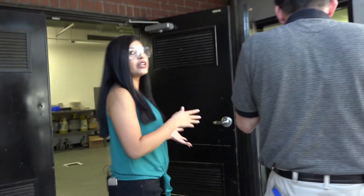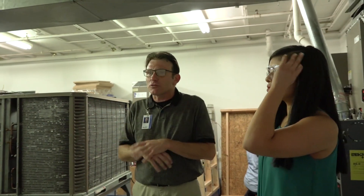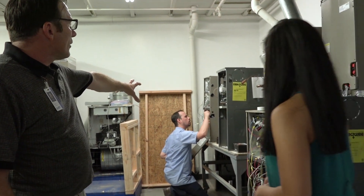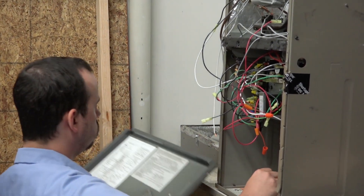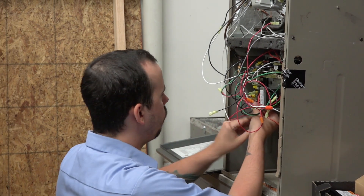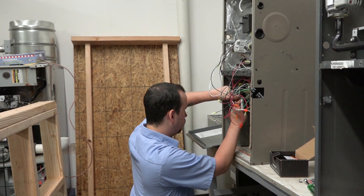Now take me inside to this other room, because I know that they're pretty busy in there. So this is where most of the hands-on stuff takes place. This is our back lab — our big work area here. We've got students doing a variety of things. Got some students back here wiring on furnaces. What he's doing here is actually wiring up an ignition module for this furnace. When we go to turn this furnace on, it has a way to light the gas inside of the furnace so we can start producing heat.